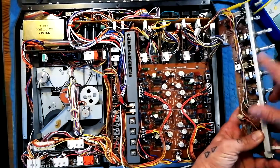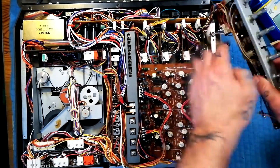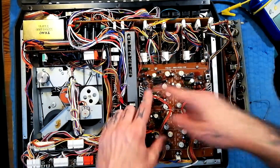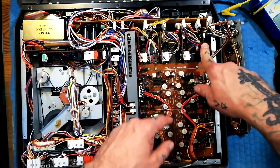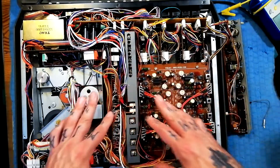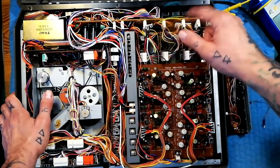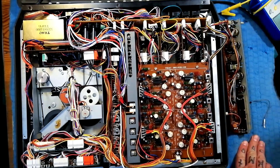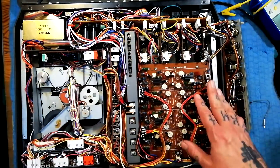For the problem with channel one, I've got a spare channel I know works, so I've just unplugged the suspected faulty mixer channel and put on this one. If you don't have a spare, and you're in a position where you know two, three, and four work but one doesn't, just lift the DBX board out and swap the two around — if it was the mixer channel at fault, you'd then have a dead mixer two in the working channel one position. It's about using deduction to prove or disprove simple hypotheses, because you don't want to jump into recapping the whole board, reflowing everything, and changing all the op-amps when it turns out it was just one fader you could have changed easily.